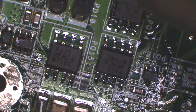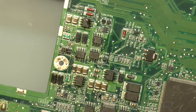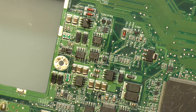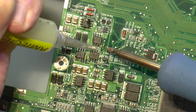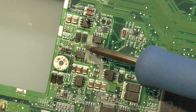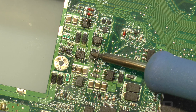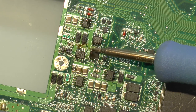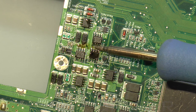These are probably ready to come off now but I want to burn the flux. I'll give it some more heat - it's starting to go brown in some areas, which is what we want. We'll put these little fellows back on - in fact let's get some more flux on the go first. We'll put the components back on, and now everything's floating. I'll also give it a burn with the soldering iron as well, just to make it like real life - leaving some dirty residue from the soldering iron. The flux is really burning now, going brown and getting burnt off.